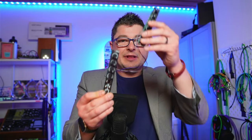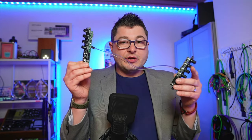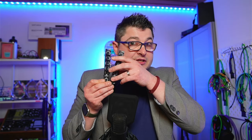Because you then have the option to place these mixes wherever you want in your rack case. And the reason for that is exactly the cables between them. Because even though this is a very straightforward matrixable mixer with four inputs, inputs 1, 2, 3 are indeed normal to any following module that you might have. So you can also use this to route any sort of signal from anywhere in your rack to another place. And of course, these cables are already quite long, but nothing is stopping you from creating your own longer cables and putting this on your 500 HP module from left to right.